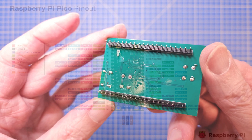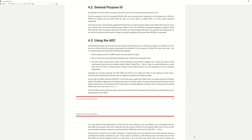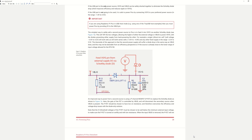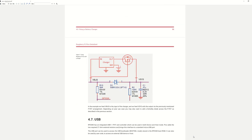There is another reason for doing this as well. The Raspberry Pi Pico is a great platform for starting to explore the RP2040, and it's relatively cheap, but there are a couple of things that I don't like with it. The first one is that it has a switch mode power supply to regulate the input voltage down to 3.3V, which causes interference issues for the ADC and surrounding analog electronics.